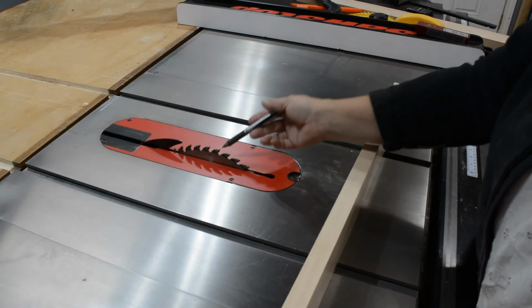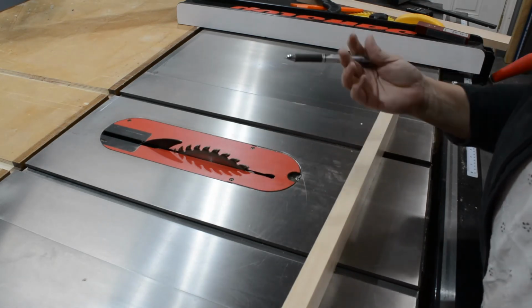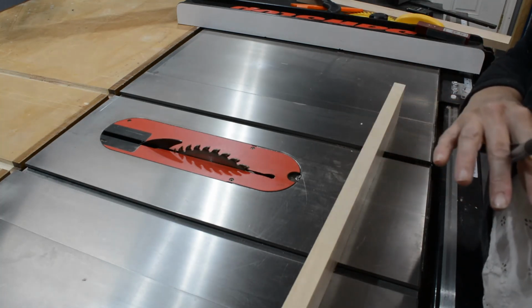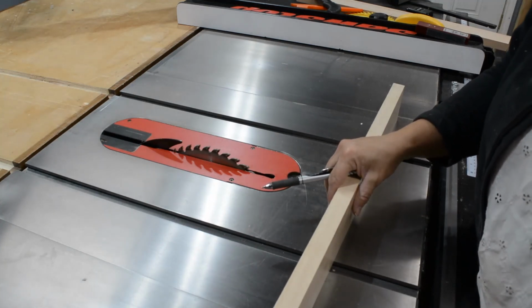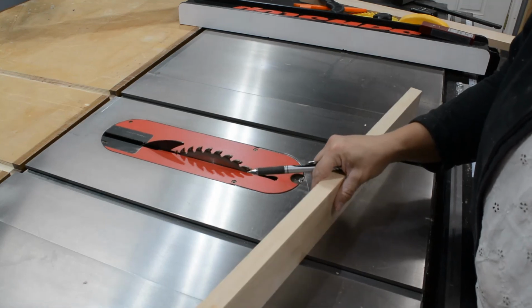I don't love it. For one thing, your kerf on a standard table saw blade is about 1/8 of an inch, and that takes a lot of material. In this case, the bandsaw is just the best tool for the job. So there are limited applications where you can do that on a table saw, but excelling at it, not so much. That's more the purview of the bandsaw.